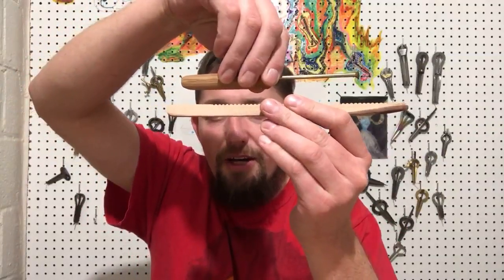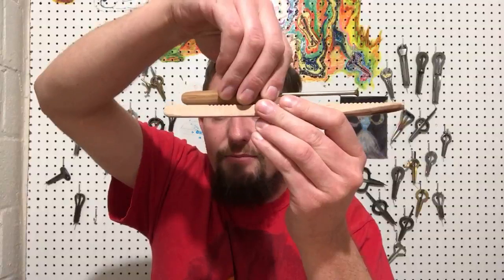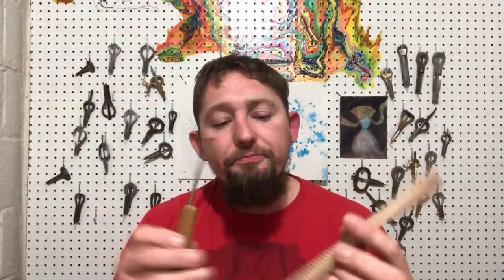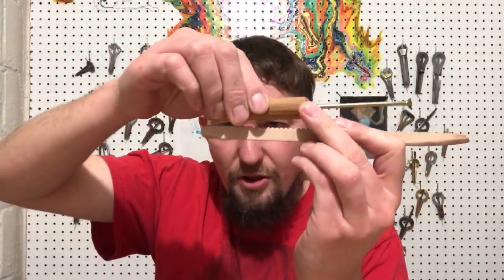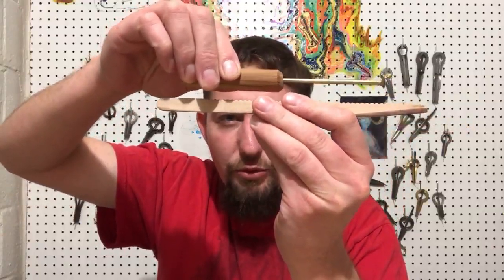And as soon as you apply a little bit of compression to them, they compress unevenly. So I made the harp so that the gaps compress down absolutely straight, because so many harps, you start playing them fast and you need to start holding them harder up against your teeth. Well, you're going to compress it a little bit more. They'll compress oftentimes at the tips a little bit more. So when I make a harp, I always want it to compress evenly.